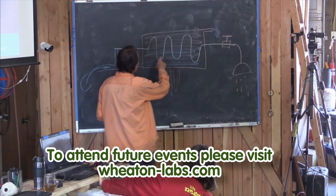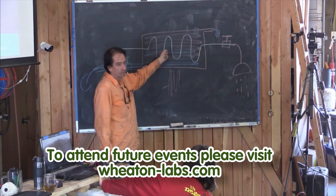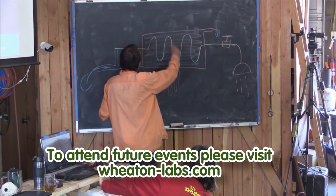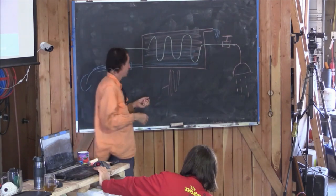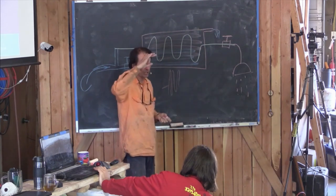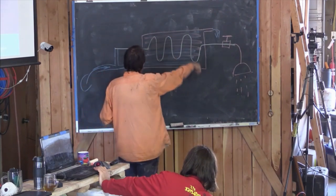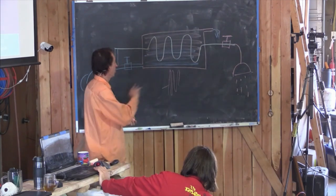You might ask, well, okay, if the water in the tank boils, then why won't it start the water in the coil boiling and then have steam formation and then bang? Number of reasons. The water in the coil is a much, much smaller volume at any given time. Plus, it's in a shape that is generally quite strong pressure-wise, because it's tubular copper pipe, rather than a drum, which may not take the same sorts of pressure. So there is that, but we're not relying on that.